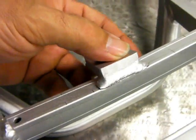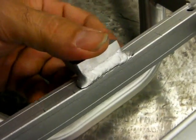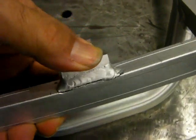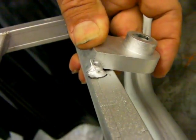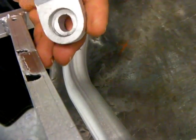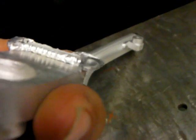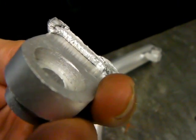I'm going to line it up the best I can, leave that fractured surface alone, get it to line up perfectly, and kind of wiggle it around until it mates up. Then I'm going to use what's known as a third hand — a homemade tool to hold it in place. You can see here how much they didn't wrap the corner, so I'm going to wrap it real good and load some weld on those edges so it can't rock much when it's in service again.